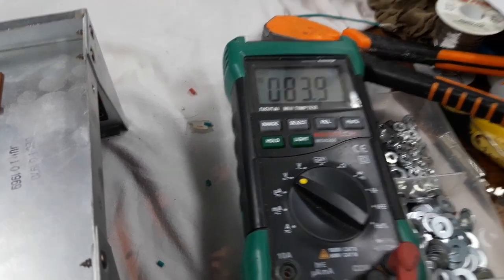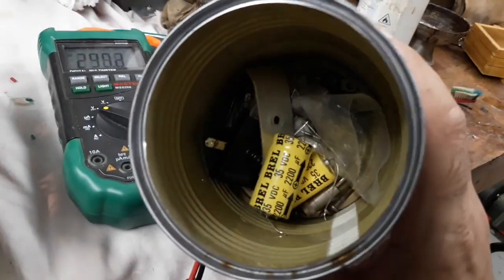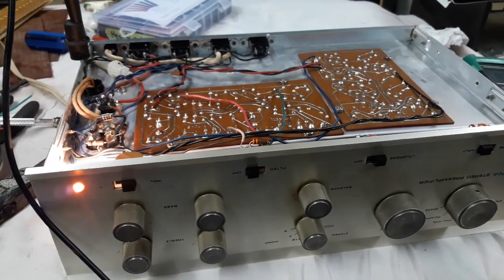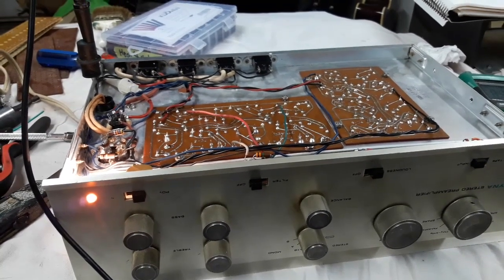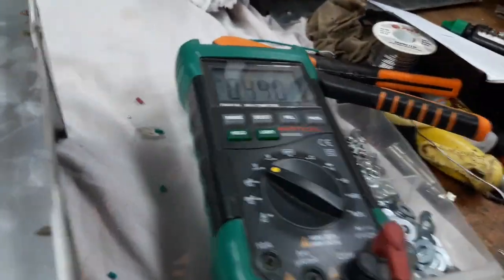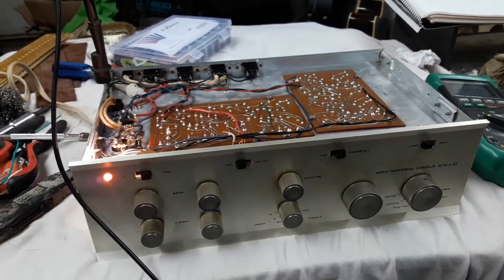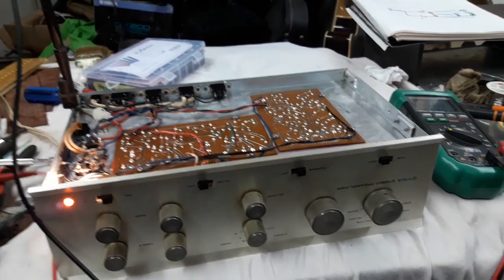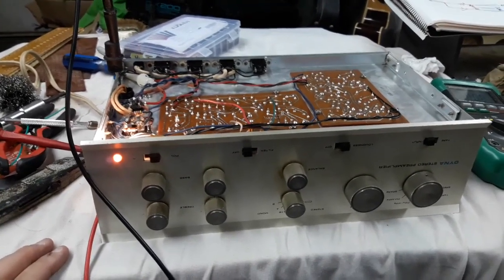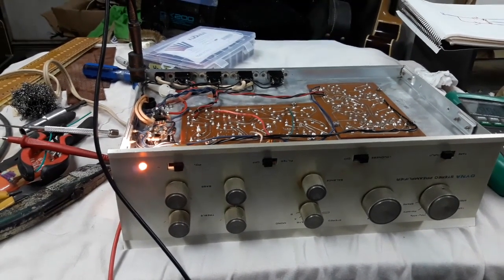Wow. So for some reason, changing out that selenium rectifier setup, all the stuff in here, has drastically eased up the current pull, and the voltages have risen. This is strange. Now the higher voltage is making me a bit alarmed, but the truth is that's the kind of correct voltage in relation to the original specs, because remember I said that we should get about 405 when the line voltage was 115. Now everything that I measure is about 10% higher than it should be, which makes sense for the increased line voltage.